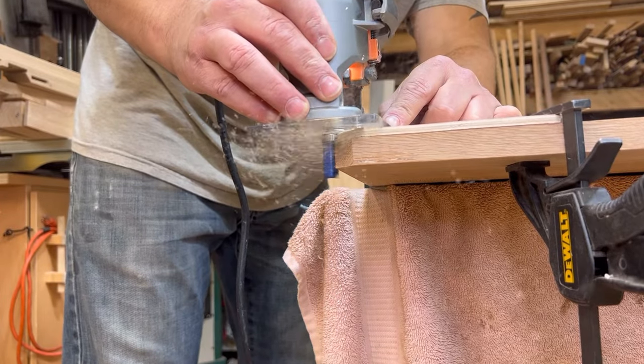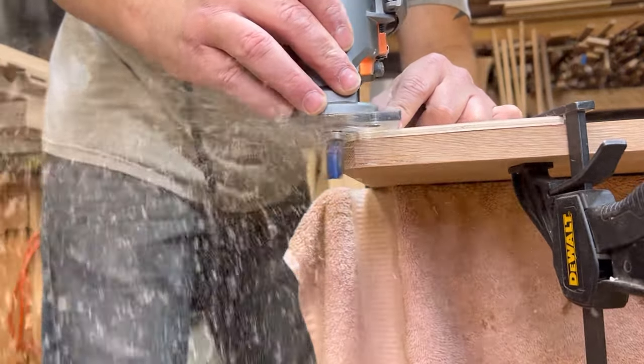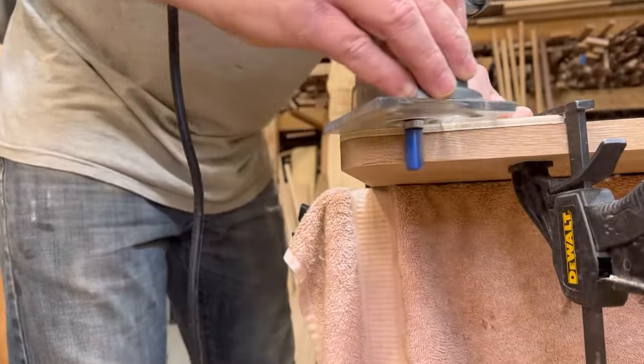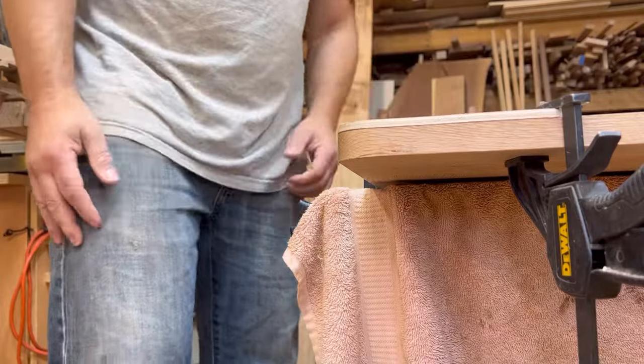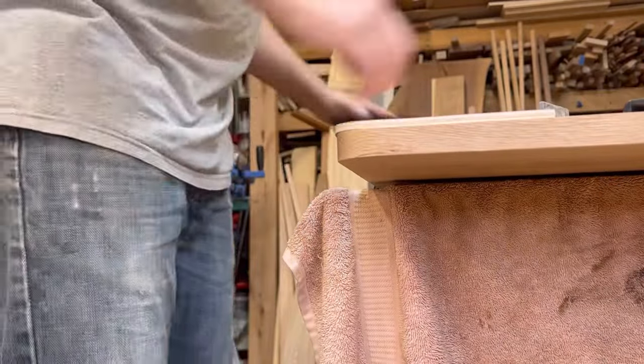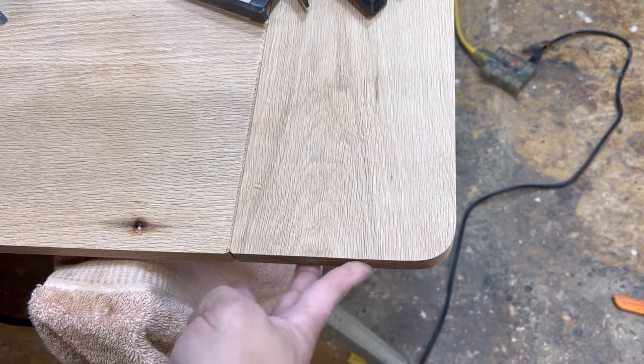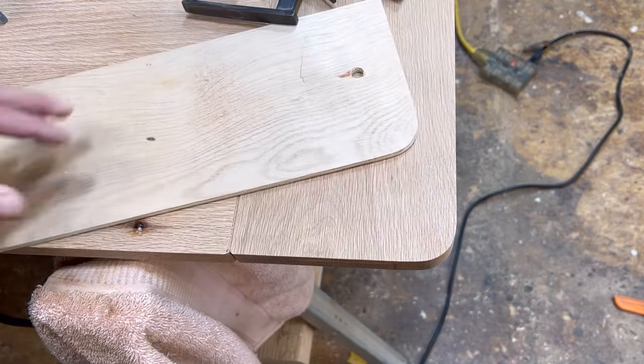And this is the easy part. I can go right around the corner, take off the sharp edges and smooth it out, and it's perfect. What's nice is being able to take it off — I can remove everything. Now I can go and put that pattern on another corner and do all the corners of the table and have them all be consistent and look that good.